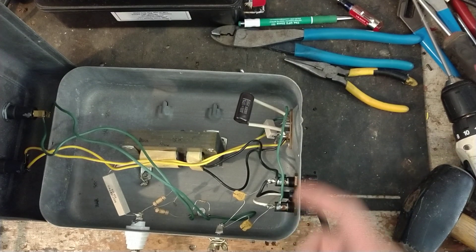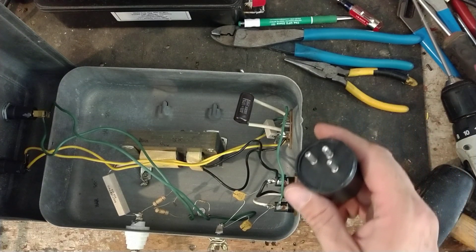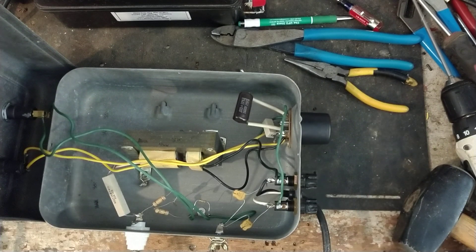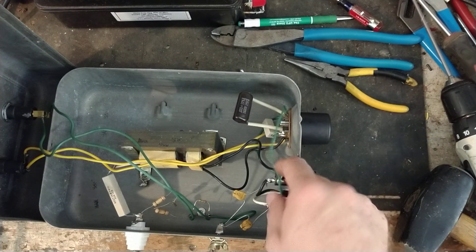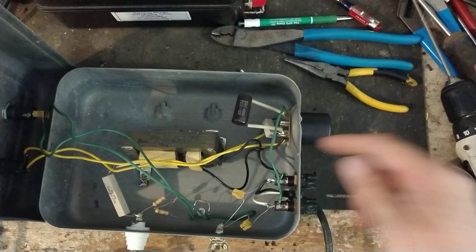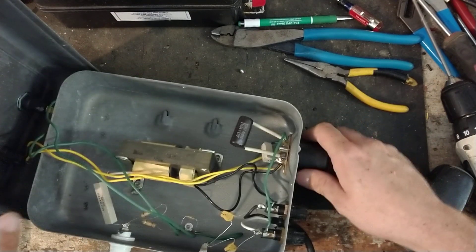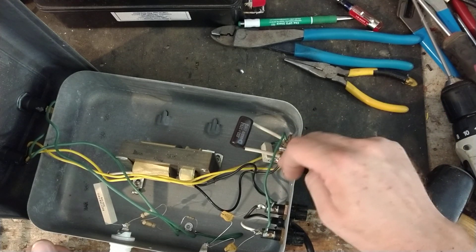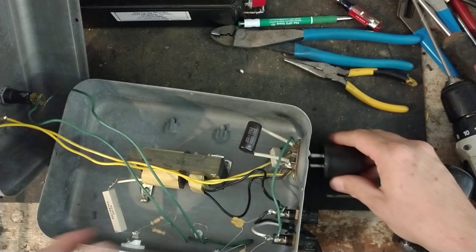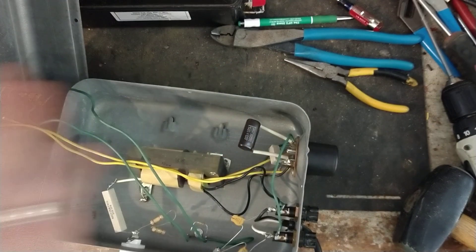This is the inside of it. Like I said, I tried a new circuit breaker — it didn't seem to help, so I put the originals back in so we could run it. It has power coming in, a couple fuses on the line side and the neutral side. They do make four-prong versions of these old weed burner types, but the four-prong and three-prong are wired up differently inside the receptacle area. The receptacle has four holes, but it comes with a three-prong — that's what you have to put in there. You can't swap them; they're all wired up differently.